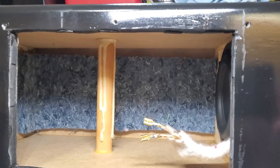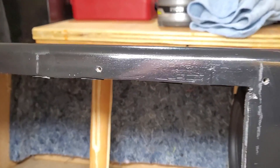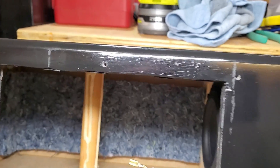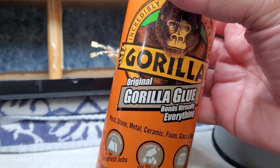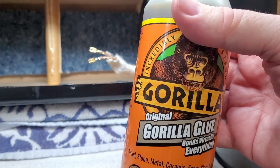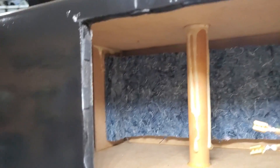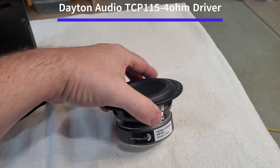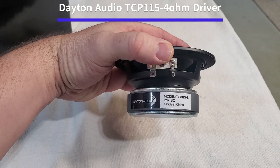To close it out and do all the slot porting, I had to leave one side open. I left the top part open to do all the slot porting, then closed it up using gorilla glue, which foams up about one and a half times its original mass. It foams up really well and gives a good connection. You can see it at all these ports on that one side where it looks like it's sealed up really well.